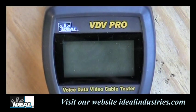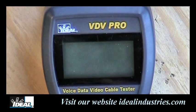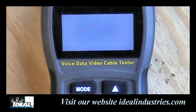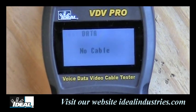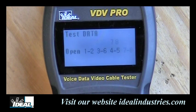Now, if you're going to use the VDV Pro to trace cables or as a tone generator, basically what we're going to do is we're going to turn the tester on, and we're using it for tracing of wires. Now, the tester is meant for tracing wires through end-to-end, not through walls necessarily. And you'll find that you can trace wires that are pretty long, usually about 500 or 600 feet.